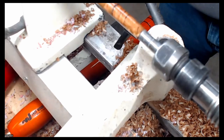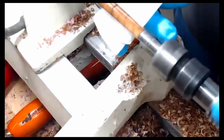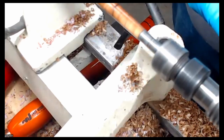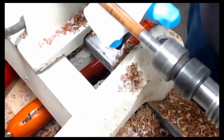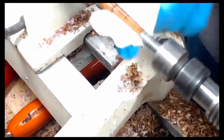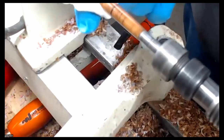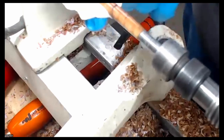Tricked myself. So now I put the first two coats on without it spinning. Now I'm going to put this next coat on with it spinning. Put the linseed oil back on again, my flashover. And because it's so warm in my shop right now, this is flashing really fast. I'm going to keep going until my finger gets warm. Don't stop this paper, whatever you do. You stop the paper, it's stuck to the blank, and you'll get your sandpaper out and start over.